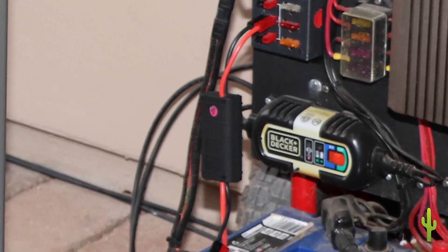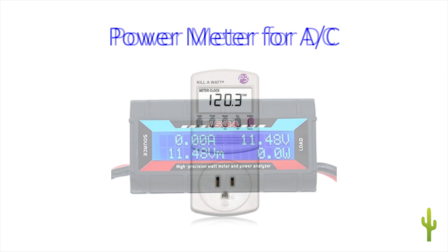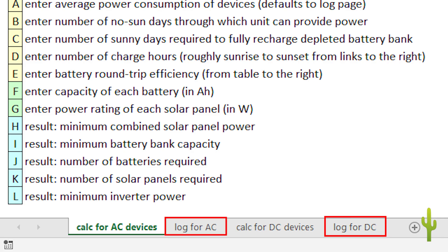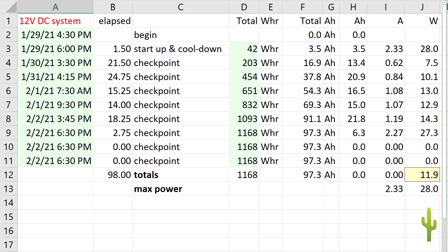To log power consumption, get a meter and directly measure the power used. Depending on whether your devices run on AC or DC power, you'll need different meters. For AC devices I use this meter to measure power in kilowatt hours. For DC powered devices I use this meter to measure it in watt hours. There are links to both in the description below and in the design spreadsheet. For each of the AC and DC type projects there's a companion logging sheet. Choose the appropriate log sheet — AC or DC — and record the timestamps and power measurements in the tinted columns. Add new values periodically across your test period. Begin your log by recording the start date and time in the first row. Over the next few days record the date, time, and the accumulated power — kilowatt hours for AC devices, or watt hours for DC devices.